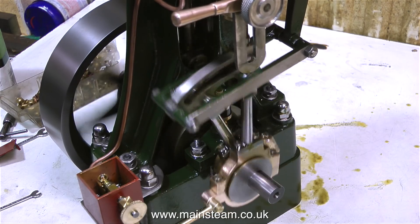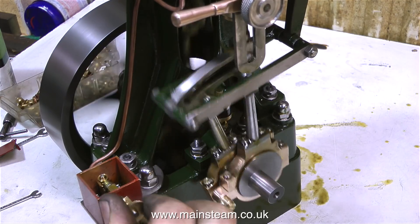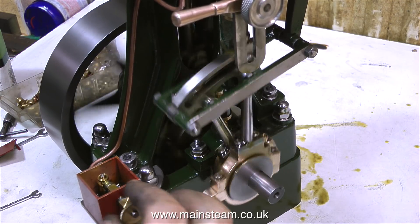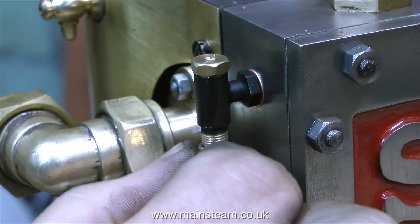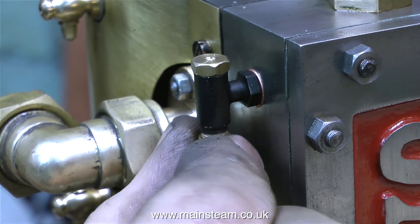It wouldn't be quite so bad if it was a steam pipe, because as soon as you connected it up you would realise there's no steam coming out — it must be blocked. But when it's an oil pipe, you don't know. The only way to find out is wait a while and see if any oil comes out of the exhaust. Particularly if you're running on superheated steam, by the time you realise there's no oil coming out of the engine, the cylinder bore and possibly the piston rings could be damaged. So I always leave the pipe disconnected and run the engine. While I've been running this engine on compressed air, I've been injecting some oil into the airline. But now I have a lubricator, I won't have to do that. After a while, a very small blob of oil starts to appear at the top of the pipe — and here comes another one. It's only taken about 10 minutes. Now I've clearly seen oil being pumped up the pipe, I can connect the clack valve. I can steam this engine with confidence, because I know that as long as the lubricator's full of oil, it's getting pumped regularly into the steam chest.